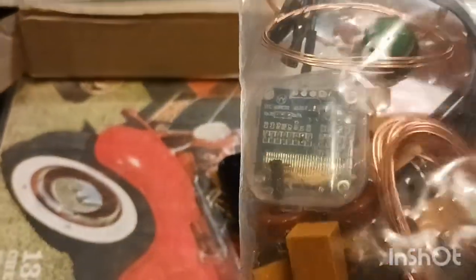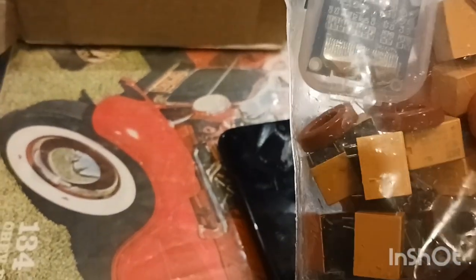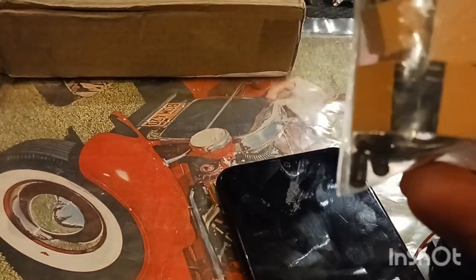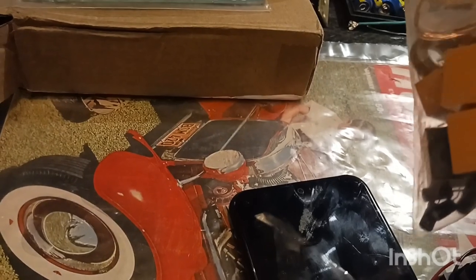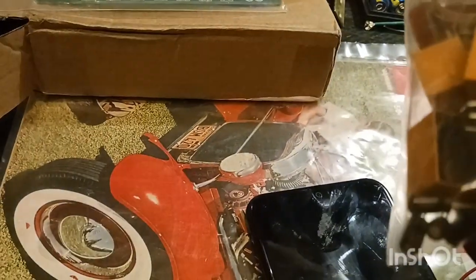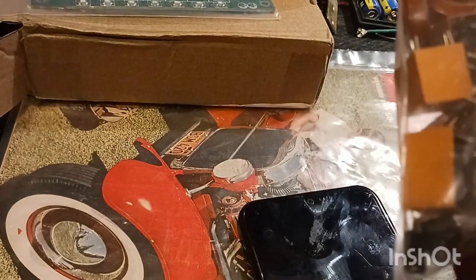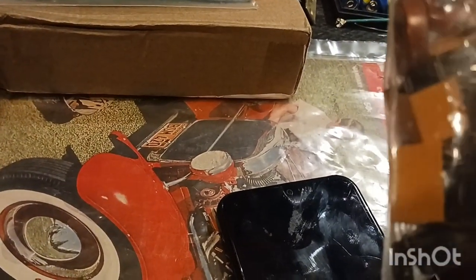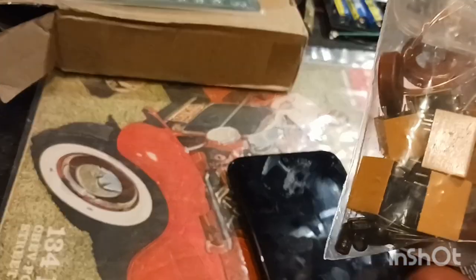As long as I'm in, I found a small schematic for this online, but hopefully I can find a better one. And I think I can get to work. But I'm still going to have to order some pieces because it's got SMA cables. Right there's one of them. So I'm going to have to order extra cable to hook to that so I can get to a UHF cable. You know what I mean? And Temu, or I don't know how to pronounce that, Timi or Timu, they have those SMA cables for $4.48 a piece. So I'm going to be in, it's probably another $10.